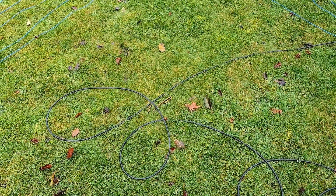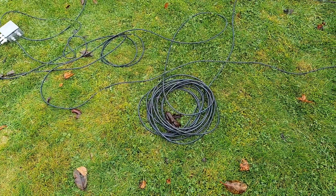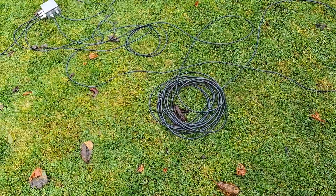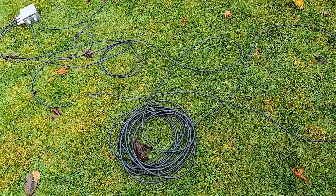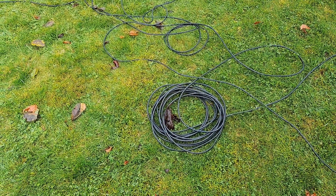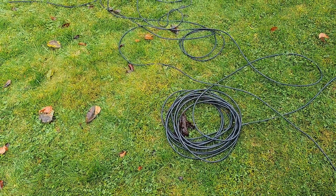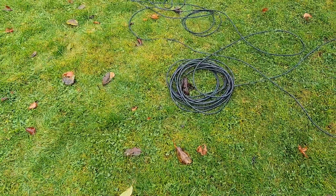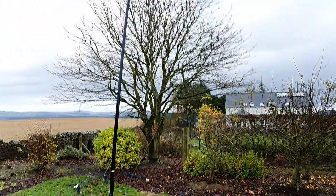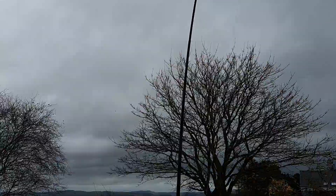This is Messi & Paoloni UltraFlex 7 — fantastic coax. The coax I've used for the phasing network is the Super Mini 8 — the stuff we buy from Nevada here in the UK. It's quite good coax; you wouldn't want to use it on higher frequencies, but it's got pretty much the same loss or just slightly more than RG-213. It's very good value and on these lower bands the losses are not worth talking about.